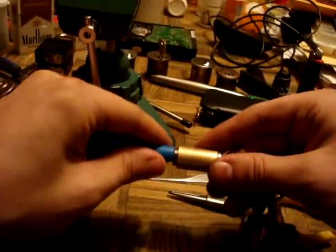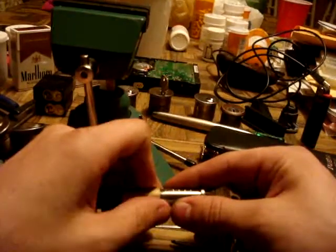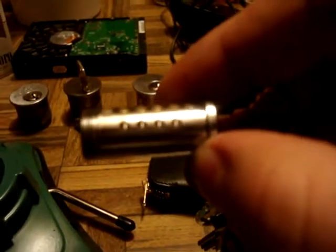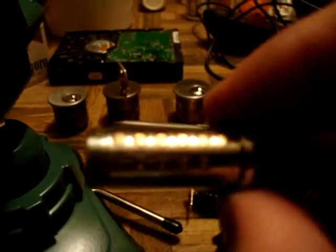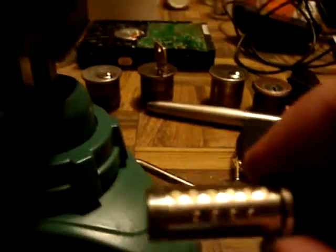I'm gonna use my little spools that are found in it. There we go — there's all six pins. All regular pins. One little question I had: see those four holes there, in line with the middle four pins? I'm not sure what those holes are all about — I milled into the plug. Anyway, that's a Schlage knockoff, six pin, picked, pulled open to verify.